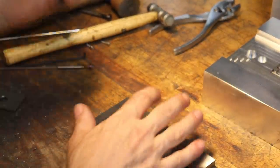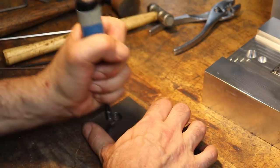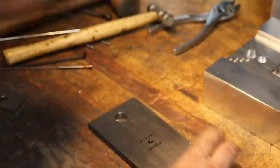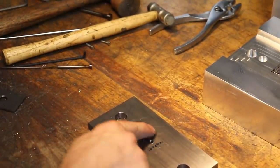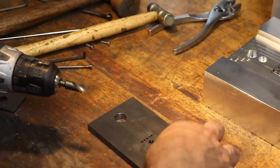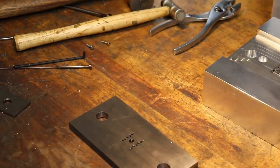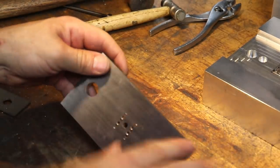Feels like I need to deburr the backside. I always pull up a burr when I grind. So let's do that. And we need to do the same thing by adding a little bit of a lead in to only the ejector holes, because some of these features are actual mold cavity features. So I guess we can do that now. Okay, so now at the 11th hour, we won't be fussing about how an ejector pin's not going through there, hopefully.